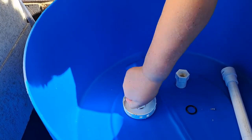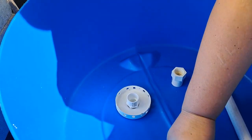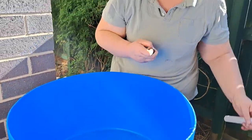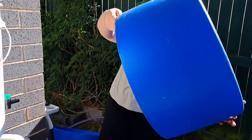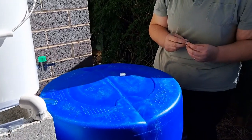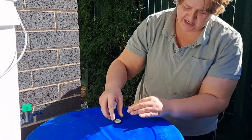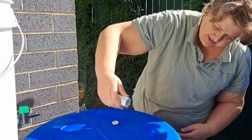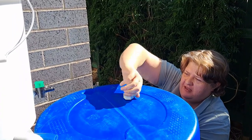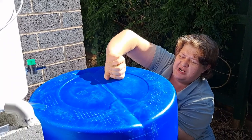Alright. And I can feel that's gone through. Now I need to move my screws out of here. So we have pockets. And we're going to keep the standpipe out as well for the minute. Turn that over, and if you're doing it on a big aquaponics system, you're going to have to get underneath it. Okay, second, or in my case third, O-ring here helps with the leaks. And then we're screwing, this is the female part on. And nice and tight, and what that's doing as I'm putting pressure on both, that's screwing it in from underneath as well.